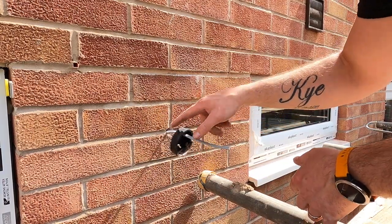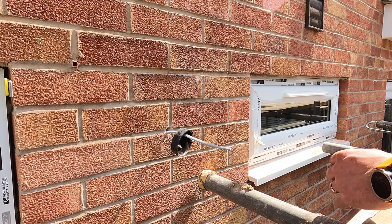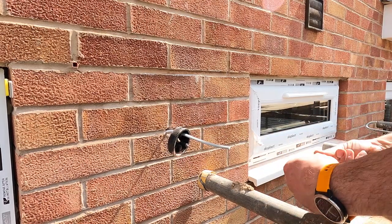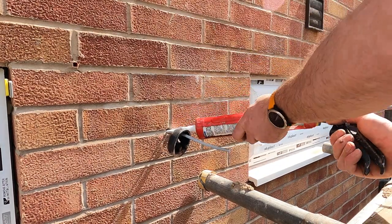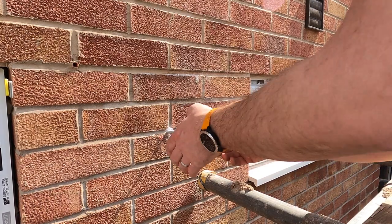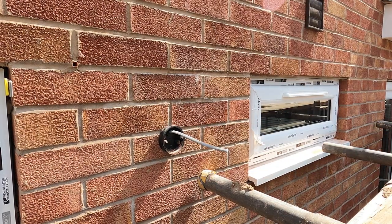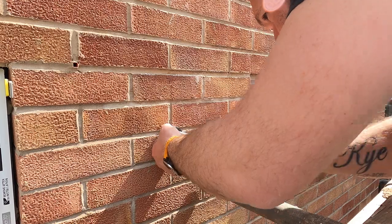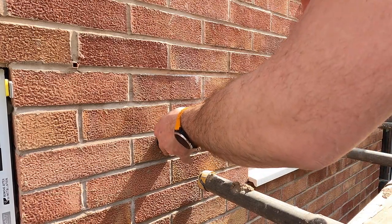As you can see, I always drill downwards because the cable comes through that way — to get me by 150mm into the corner, which is within the prescribed zones for cable runs. Get that in first, get the fire sealant in there, seal all that up, and then I can slide the fitting back.